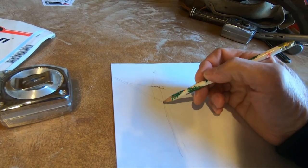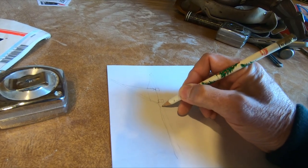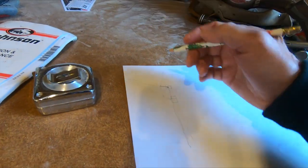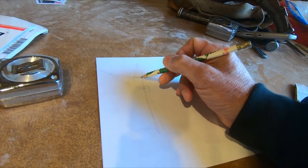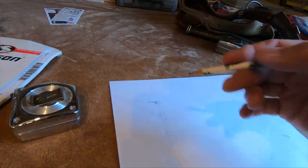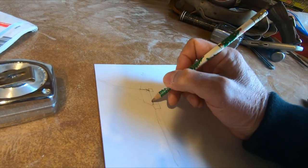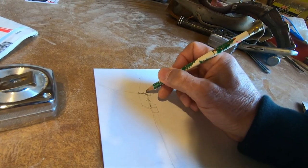So during raising the sail, that line is slack. This sleeve will sit right above the sleeve that the gaff rides on, should stay out of the way. Get the sail up, then pull down on this line, drawing the bridle in toward the mast, tensioning the peak. The only issue is — and I'm just going to have to try this — it's going to have to work itself up as that line's tension slides along the mast into position. It might stick there.